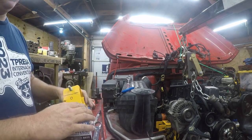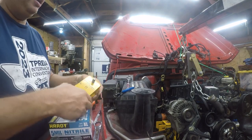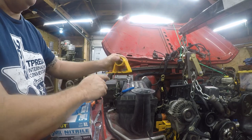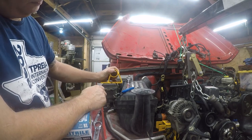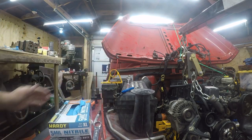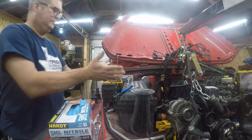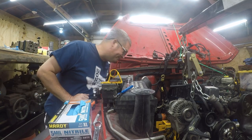And then I have to evaluate, do I want to allow this much overhang? So if my force is downward, is this enough? I think this needs to be backed up. I really do. So my other alternative is to cut a piece of metal to scab this.